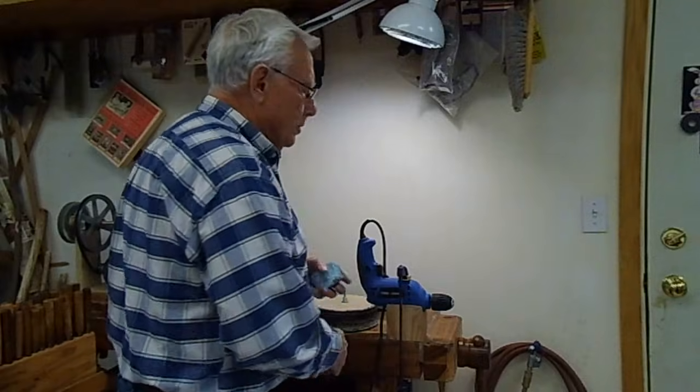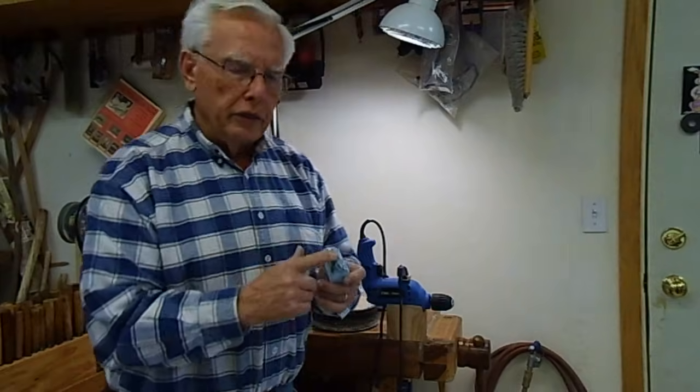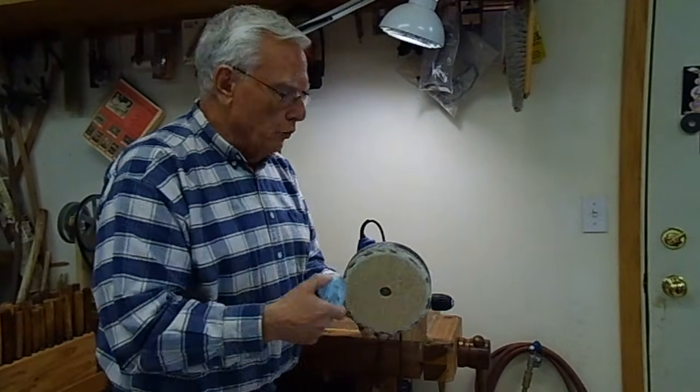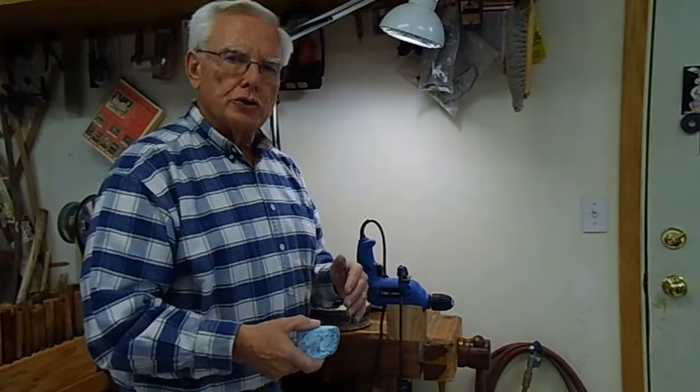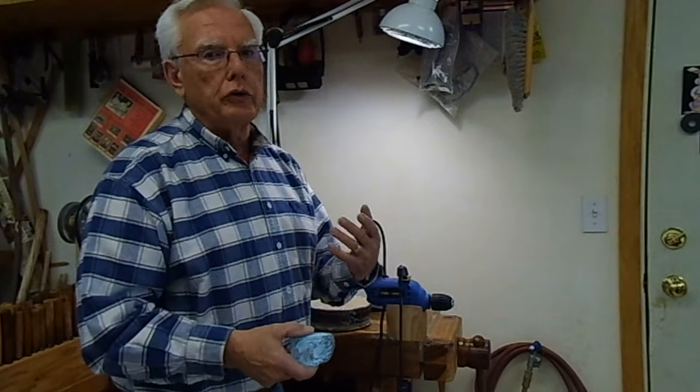On the buffing wheel there are many types of buffing compounds. You go to the hardware store and in the buffing section there are sticks of buffing compound. Get any one but don't get the one for plexiglass, because plexiglass has a finer particle and it takes longer to buff — it will still work but just takes longer. This is about a half micron buffing particle, which is what is actually removing the metal. It's not quite optical quality, but it really polishes the edge nicely where you can still shave with the tool and it cuts very well for wood.